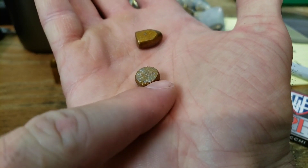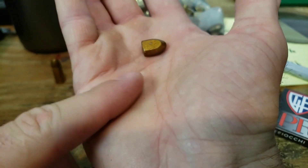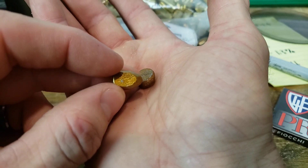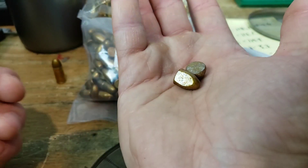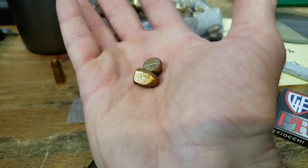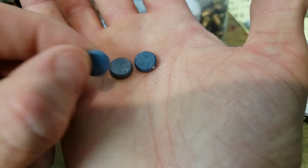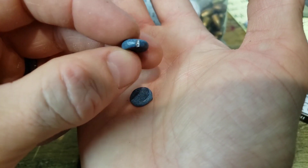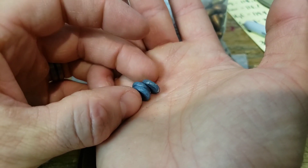Let me mention the smash test. You can see some coating started to flake off, but I smashed the hell out of it — way more compression than going down a barrel. We did another one a little flatter, more realistic. It's a good coating, properly bonded to the bullet. Now compare that to some powder-coated double-aught buck pellets I cast: when smashed, the coating only came off where the lead actually split. So powder coating is much more durable and can withstand much higher velocities and pressures.